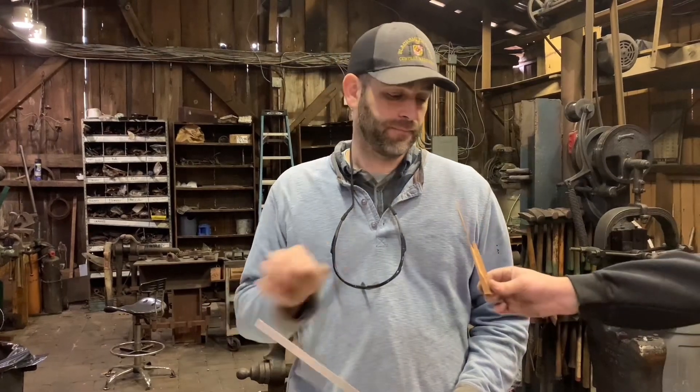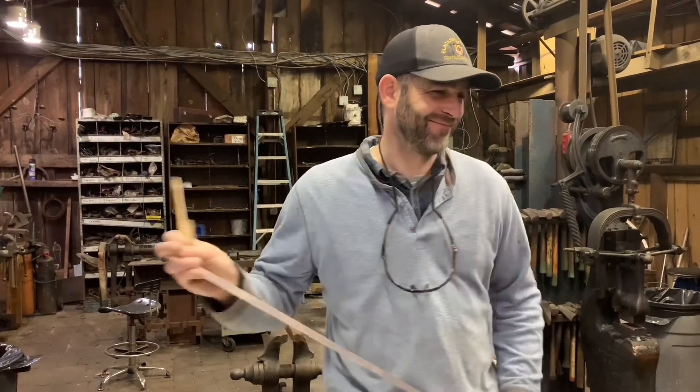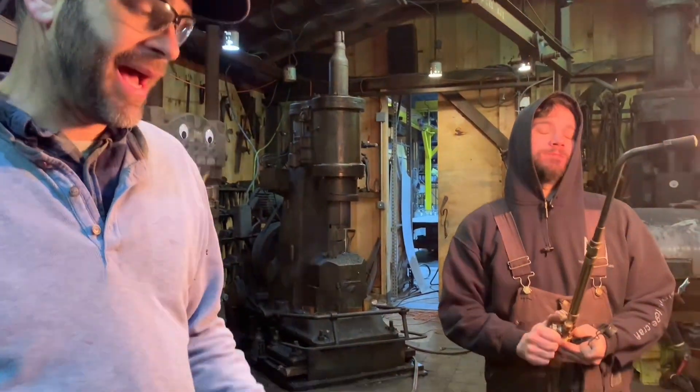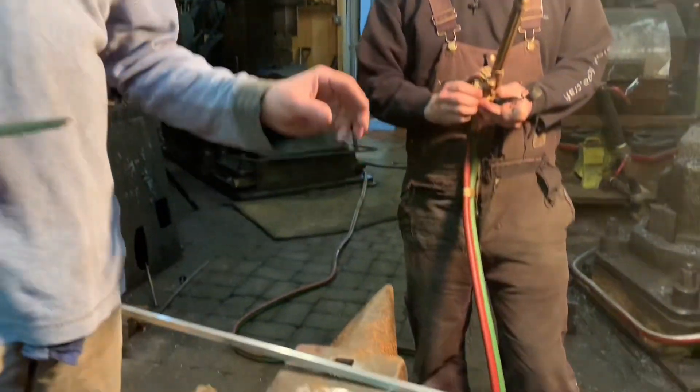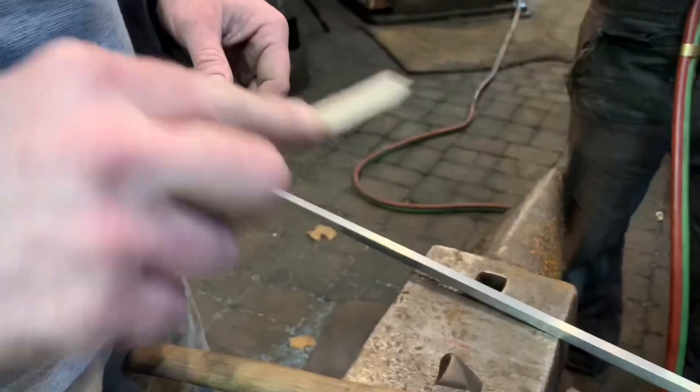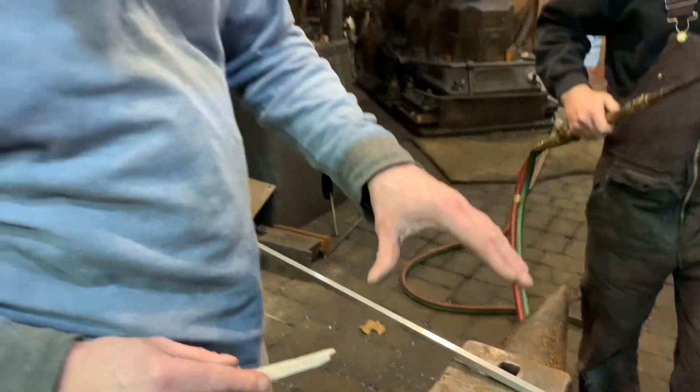Well, we're going to show you how. Jared is going to heat the aluminum while I forge it. How I'm going to tell how hot the aluminum is — by a simple pine stick. Rubbing that on the surface of the aluminum when it's heated. When it starts turning a dark brown, not a light brown but a dark brown, then you know it's ready to forge. It's soft enough but it's not going to melt away.